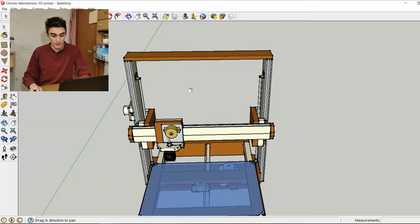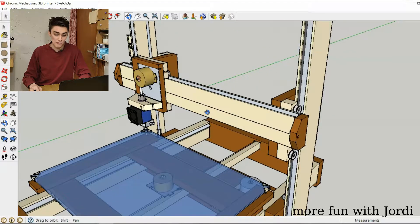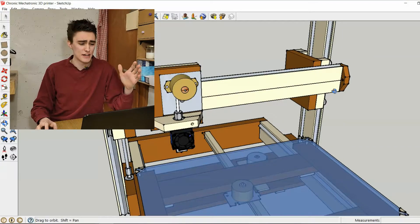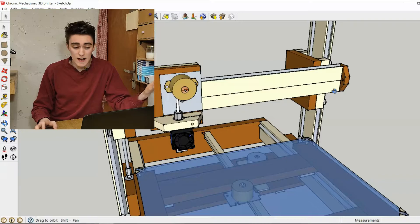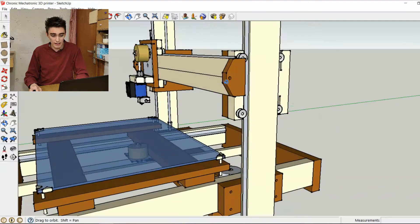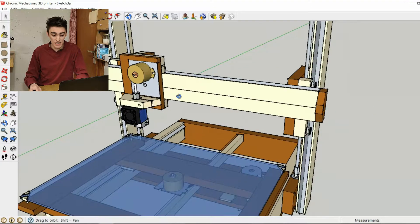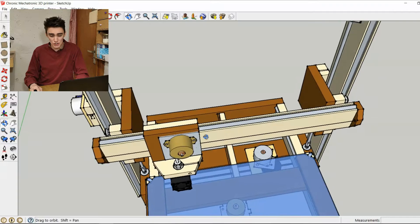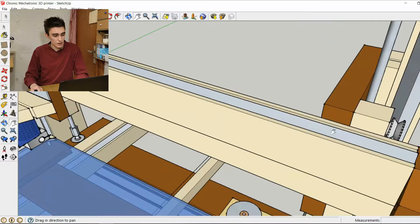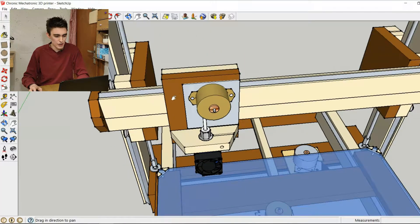A little exception here is actually the x-axis rail. There is no way I could make this out of MDF simply because it's not stiff enough — I have to use Baltic birch plywood for the x-axis rail. But I think it's okay because we should have a little bit of give in these roller bearings down here and over there. There should be at least a few tenths of a millimeter of give before it starts to bend the entire gantry. So it should work — I don't see any reason for it not working.